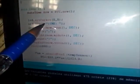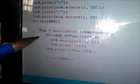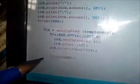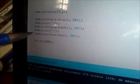Let us see it. Okay, this is it. We declare RTC now to start functioning with LCD. First line, we display time, hour, minute, and seconds. Then we input the variable voltage for the temperature sensor, VIN, analog read temperature sensor, to calculate the temperature in Celsius, then print it on LCD. I just put a delay of 1 second. Then lastly, we display at column 7 of the second row the date, which is year, month, and day.